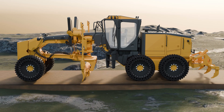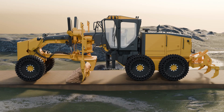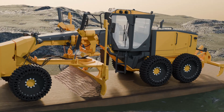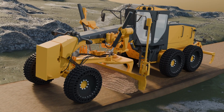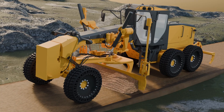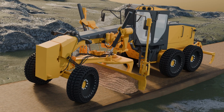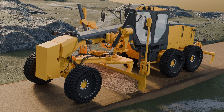To do this, they will first build up a heavy amount of material in front of the blade of the grader, then disengage the rear tires from propelling the machine. Once this is done, the operator will put full power to the front two tires while dragging a heavy cut, twisting and turning the tires in every way possible to try and make the tires fail.